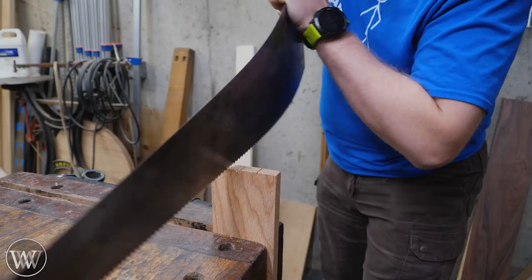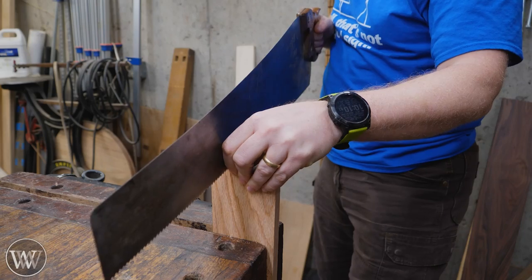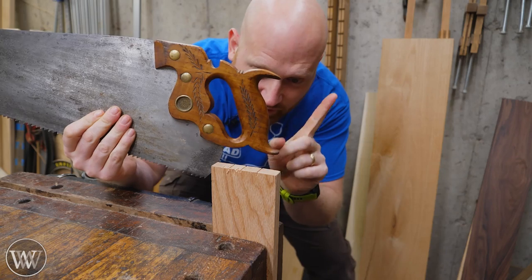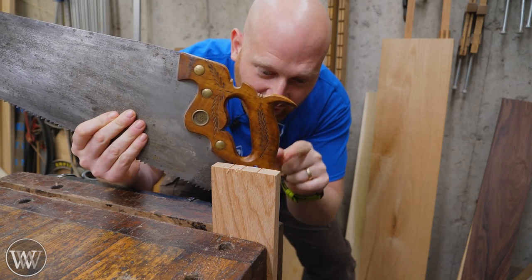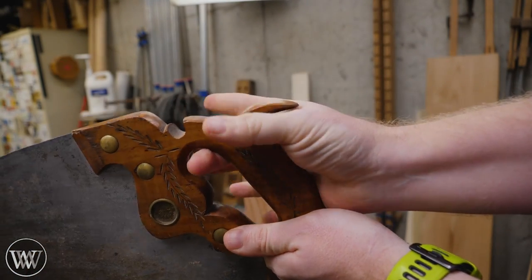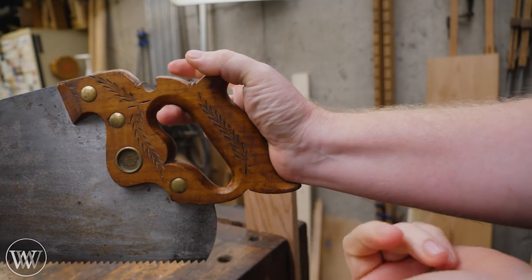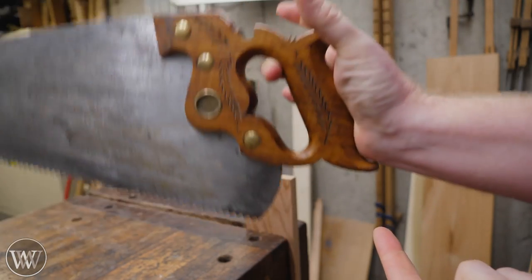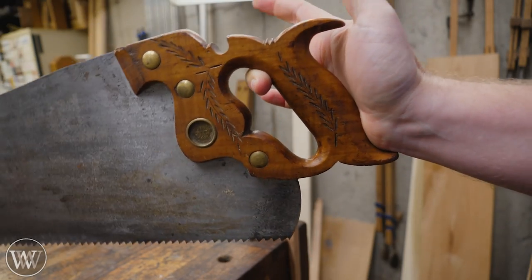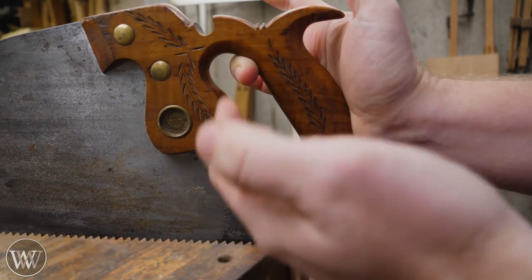The problem is how do we stop the saw from jamming in on that first stroke? The trick is this horn down here — probably the most valuable thing on this entire saw. This horn allows you to control the entire saw. When I hold this big saw, my middle finger rests up in here, my pointer finger goes straight along, and all the weight is rested between my middle finger and the bottom of this horn. This horn is what's actually lifting the whole weight of the saw. As I push down on the horn, the saw goes up; as I let the horn come up, the saw goes down. All of the control is back at the back of my palm on this bottom horn and my middle finger.